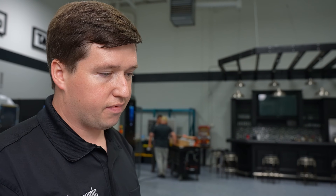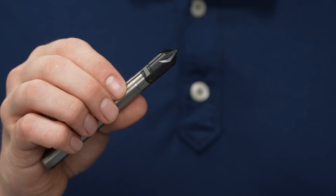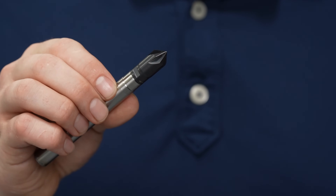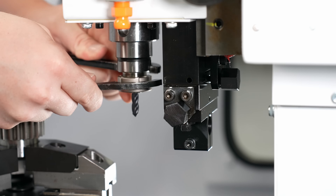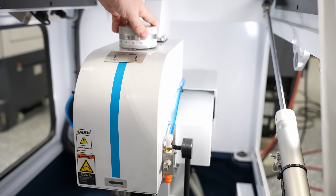Once you have that figured out, we can move on to the third thing you need, and that is your chamfer mill. Typically, we use just a 90-degree four-flute chamfer mill in this machine. It goes into an ER-style collet, so you just throw it up into the collet, tighten it down, and that's it. That is everything we need to go over as far as setting up our machine. Now let's throw everything in there and deburr a gear.